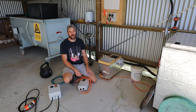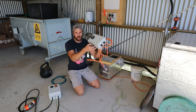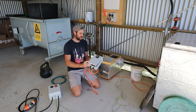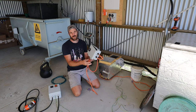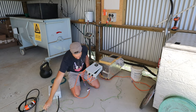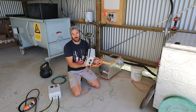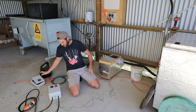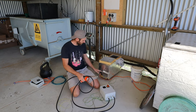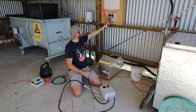We're outside here with our boiler. I've got the top off so I can access the water. I've taken our old PID controller off the wall - this is it here - it's run for me for a number of years, been really good and really simple in its construction. I've disconnected the thermocouple - that long one there - and also disconnected the float switch. Both are now wired into my new one, so the old one goes into storage as a backup. This is the new one here, a bit bigger, with this element and plug.